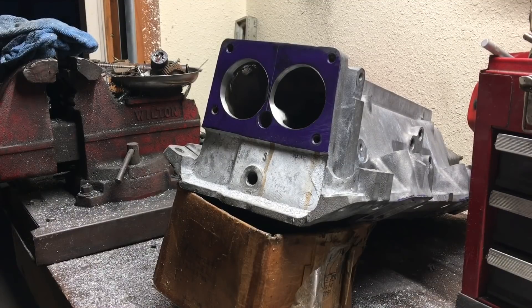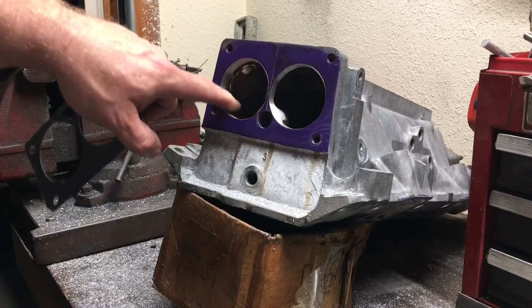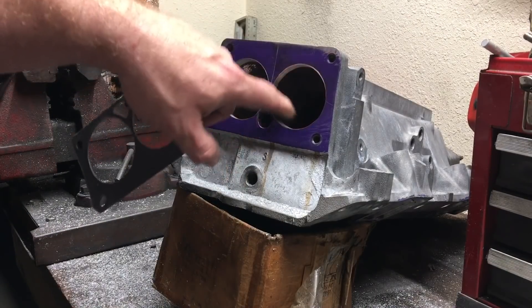I can't stress enough: with this procedure, if you want it to turn out halfway round, you're going to have to do it in stages. Start with your rough material removal, come in with a medium-aggressiveness burr to get a little closer to the line, then come in with your finer, tuned burr. Since this is a round surface, you want to use the biggest diameter fine-cut or double-cut you can find — bigger the burr, the better — because it'll be easier to keep things smooth without digging in and getting weird lumps.